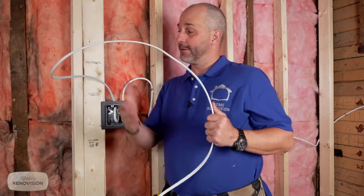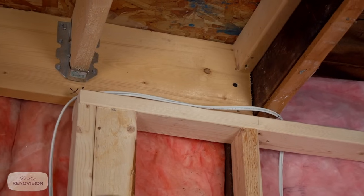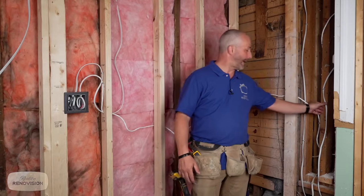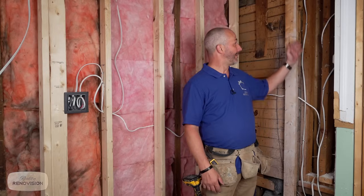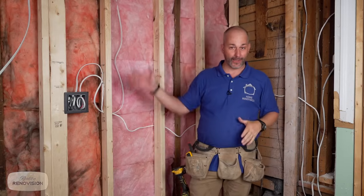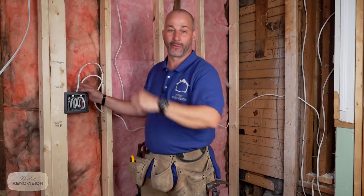And this wire is going to travel up to the first light location that's in our ceiling. So let's go into the light fixture. There we go. Now here's just a quick recap. You have your set power supply to your first location, which is a two wire. You bring a three wire, which is the black, the white, and the red, from one box to the other side of the room to your other box. And then you take your supply line from that box to your fixtures, okay?